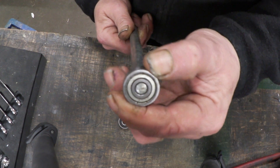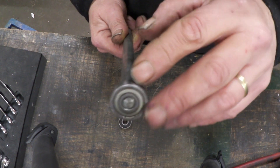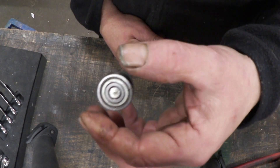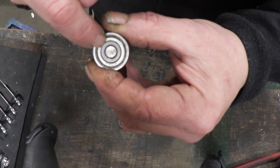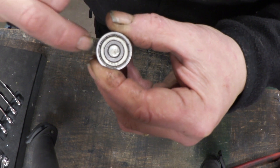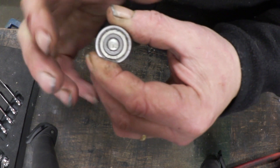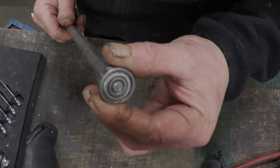That's not brilliant if you're adding a hundred kilos, but given the weight of the whirlybird it works just fine. If you take one of those whirlybirds apart you'll see this is pretty much the standard way of doing it. All we have to do is make a disc with a 22 millimetre diameter hole so it fits in the head. We need to drill a hole slightly bigger than that outer ring — 12 millimetres will be fine — so the rotor rests on the plate and we can fasten it to the larger ring.